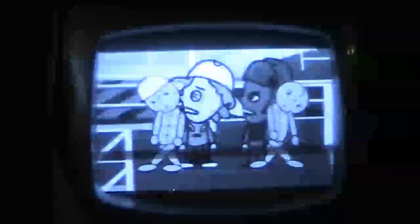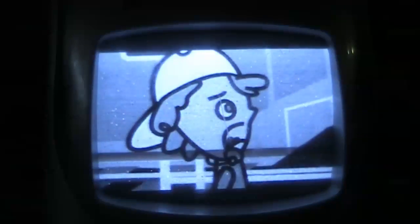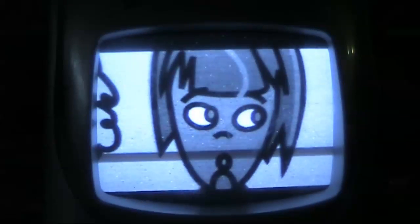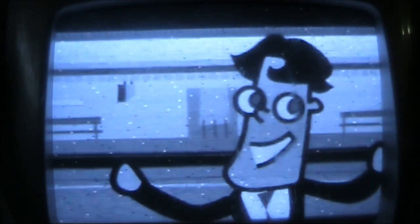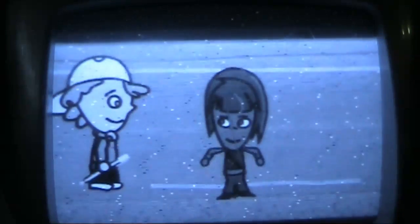Now we're starting here about 140 megahertz. And this is about the ninth multiple. And there's again a very clear picture. Got another signal here. This would be about 160 megahertz. And you'll notice as we go higher, the signals get successively weaker. Bear in mind that these nice pictures are originating with the DVD player. I wasn't able to get anything this clear with pictures coming from the digital camera.